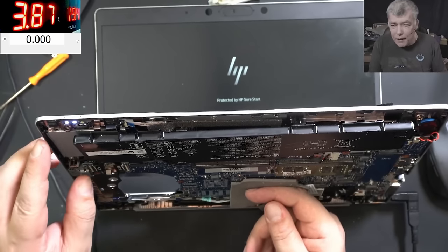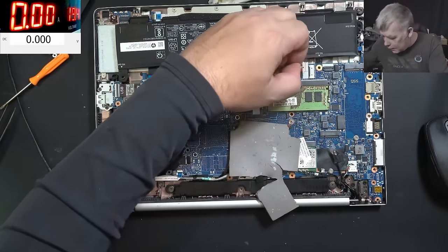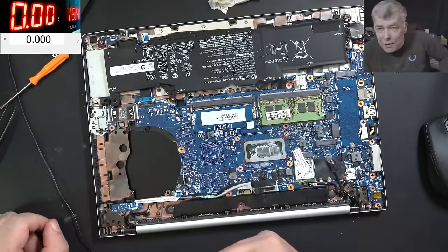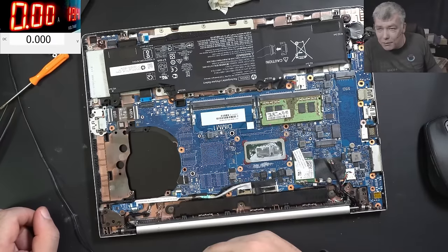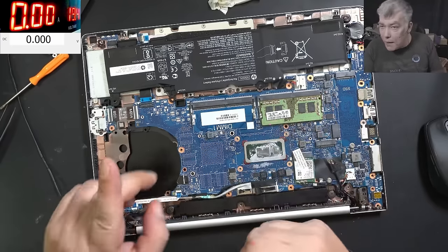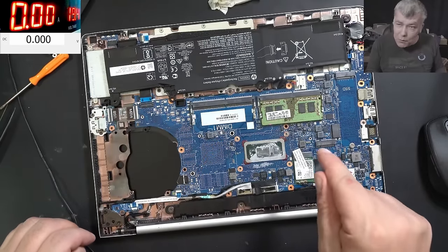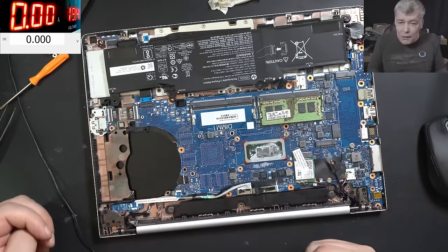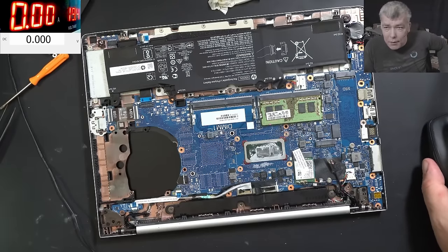It's working fine. I'm going to stop here, unplug the charger and put it all back together. Yes, sometimes just cleaning the board fixes the problem. Remember, we started with a little bit of extra current - usually 10 milliamps is fine, 20 is not. 20 milliamps for a laptop that's off is a lot. Thank you for watching, like and subscribe if you liked the video, and see you on the next one!